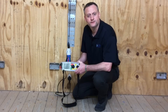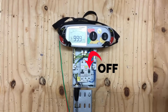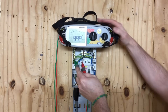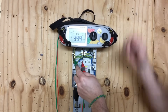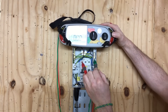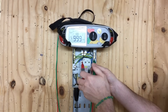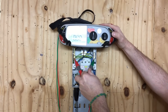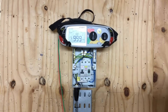Let's go on and do the insulation resistance test next. I've carried out the insulation resistance test many times on this channel before, so let's carry out once again. Connecting onto the line conductor and the earth bar - reading greater than 999 megaohms. Moving across, between line and neutral - greater than 999 megaohms. And finally between the earth bar and neutral - greater than 999 megaohms. I hope this video has been some help.